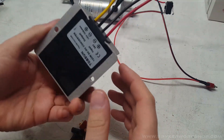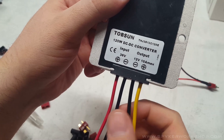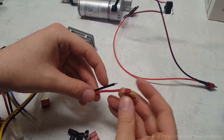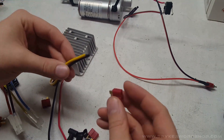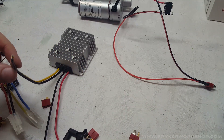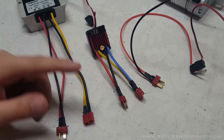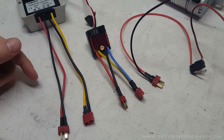On the bottom of the step-down converter it shows which wires are which. For the 36-volt input side this side will have a male connector, and then the output — which is 12 volts — will have a female connector. Here I have all the plugs assembled. Make sure that when you're actually installing these parts in the machine, you understand what voltages are coming from where, so you don't plug something into the wrong spot.